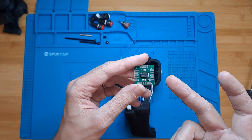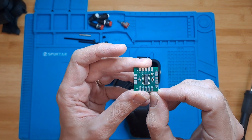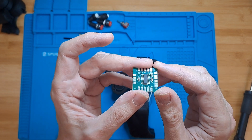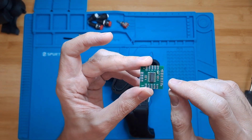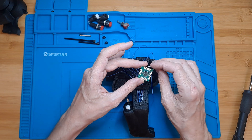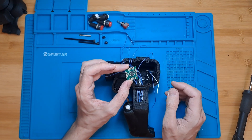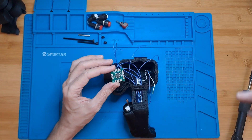My design is a pull-up shift register, meaning by default every single input pin is pulled up and reads as a one. When you press a button, it pulls down to ground. So I'll connect the common wire to one of the ground pads here — there are extra ground pads on the side dedicated for this purpose. I'll use those rather than the top and bottom pads, which I'm reserving for connecting the other shift registers. Connect the one common wire to whatever is the common on the board you're using, and the rest to the digital inputs.